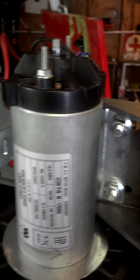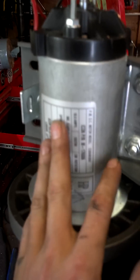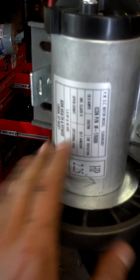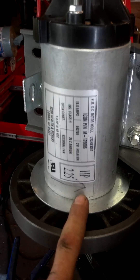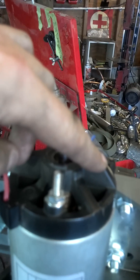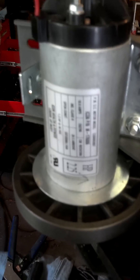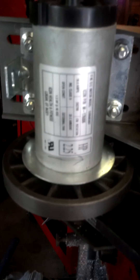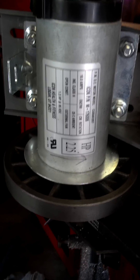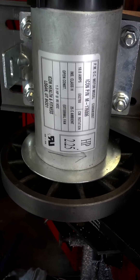The great thing about treadmills is it's a DC motor, so they're reversible — because with all DC motors you can just reverse the polarity, but you've got to be careful. Some of them are directional specific. This one was marked for the original direction, and with directional-specific motors, sometimes the brushes — located here and here — will be offset a little bit to allow better brush wear as it's rotating. I got lucky because it's a cheap Chai-com motor and the brushes were centered, so it really did not care if it ran forward or backwards.